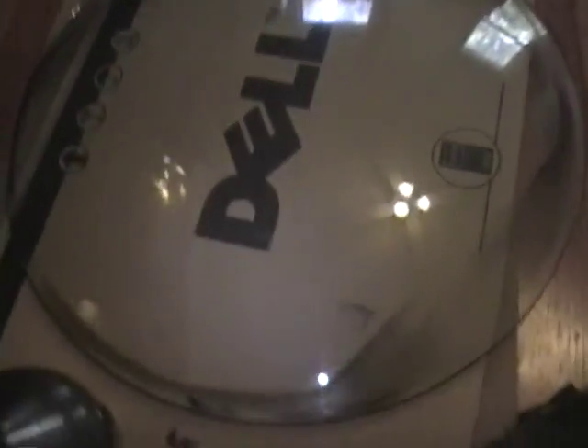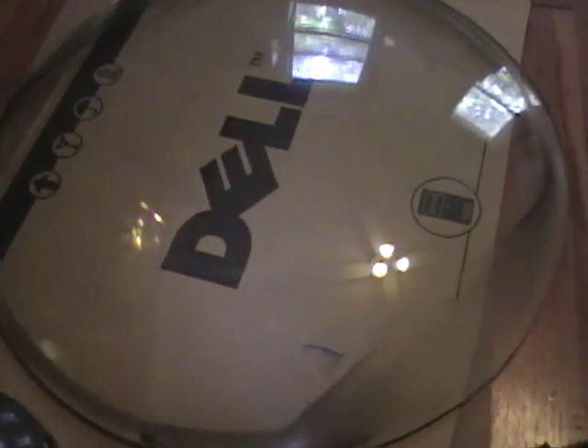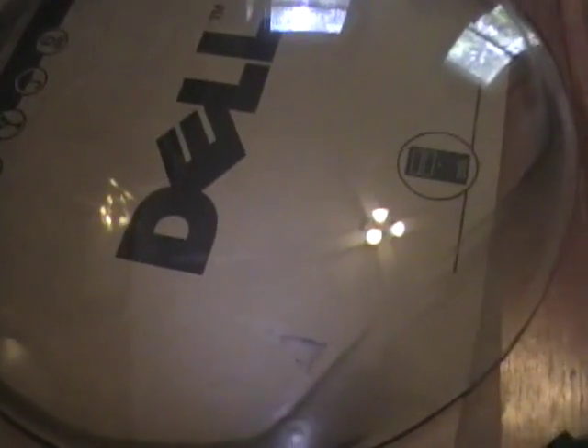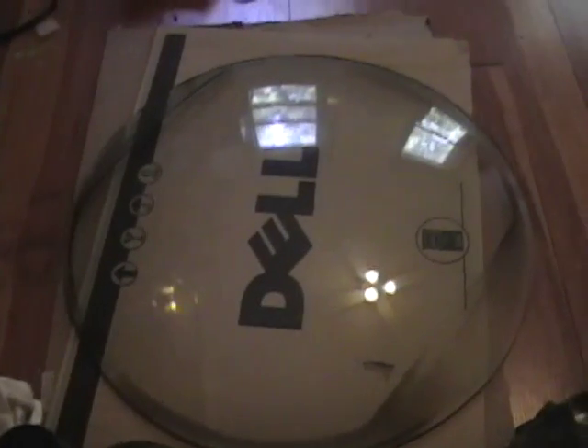So what they did to offer some protection for that is it comes with this giant piece of safety glass. Safety glass is a couple of sheets of glass with a sheet of some type of plastic membrane in between, so if the glass cracks, instead of shards coming loose, that membrane holds them intact — it'll crack like a spider web but all the pieces will still be tied together.